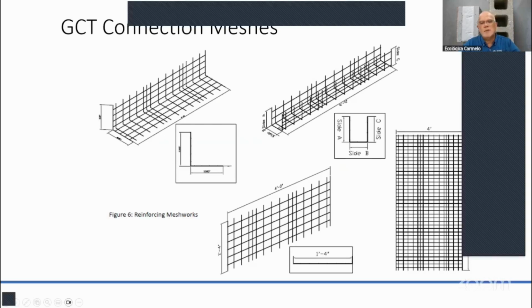Okay. Also, we have the U's, and depending on the size of the panels that you have, let's say you have a PSM 80, which is 4 inches wire to wire. That's the thickness of that panel. So you probably use an RGU 80. And these are used all around the perimeter of the windows and doors. Or let's say you have a wall where it just ends there, then on that perimeter you're going to be putting that U mesh. You never want to put mortar over foam without any mesh over it, so you have something anchoring that mortar to that wall, right?